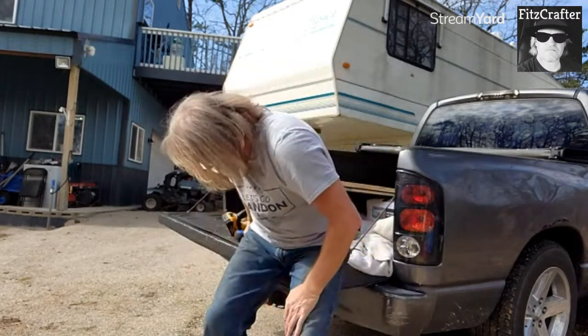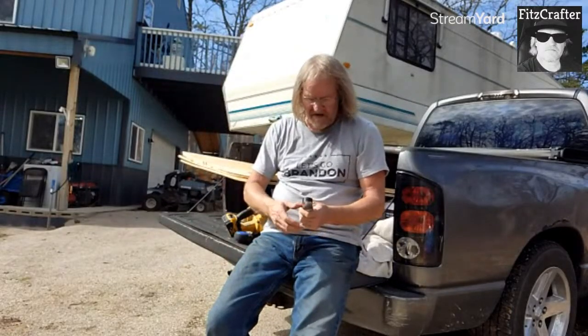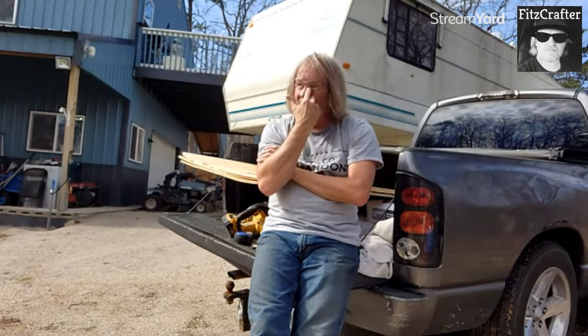I got my angle gauge over here, digital one. I'll throw a 15 degree on there and make me a cut. So these should go on fairly good now that those are squared up. Hopefully this front's not out of square too much. So that should have helped square pretty much the building up, getting those two sides done. Once that's done, I'll put some cross supports on the bottom of the legs down there to keep it from rocking.